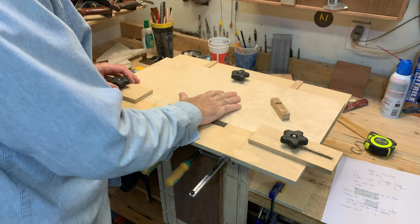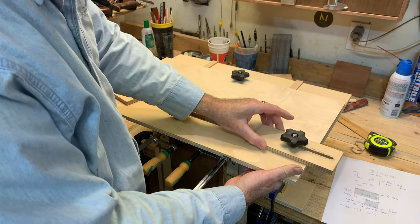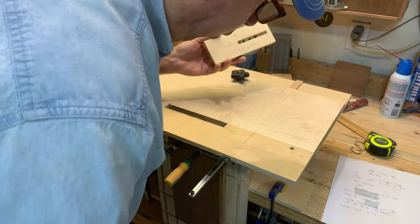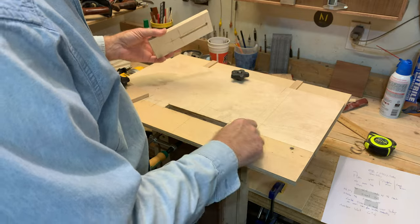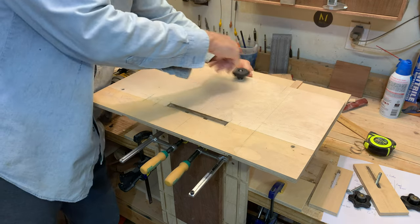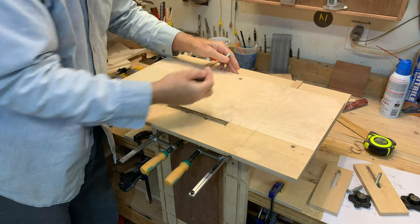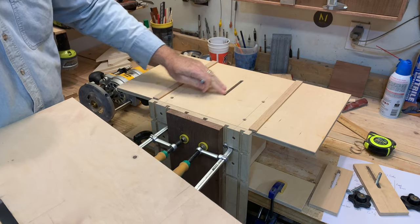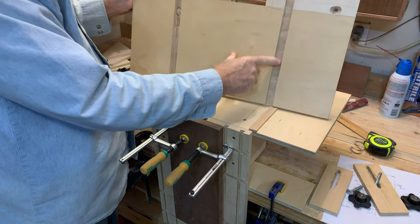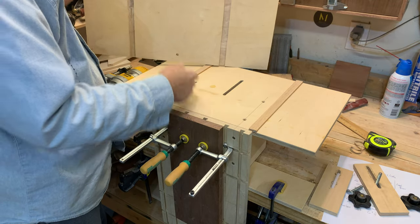So let's look at the table. The table has these two stops on it, just for the purpose of having slides — nothing fancy. In Philip Morley's version he had two stops; I have one. The back stop comes off. It goes through the top into the base through here and has that slot in there to guide this. This particular piece of plywood has grooves cut and I have my runners on the base.